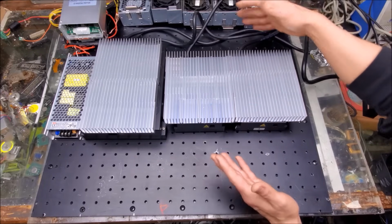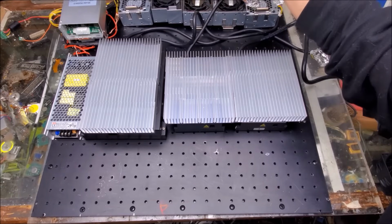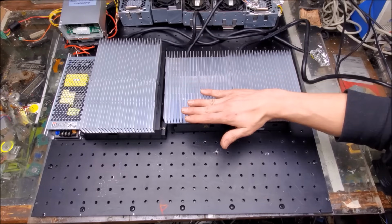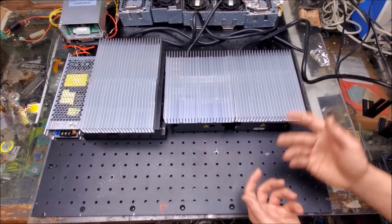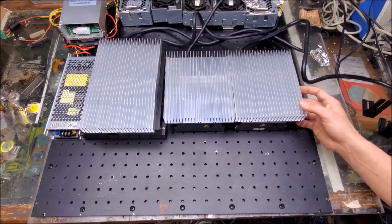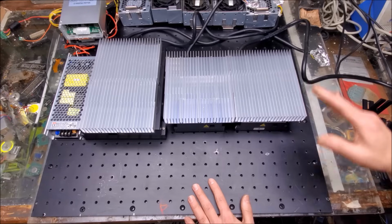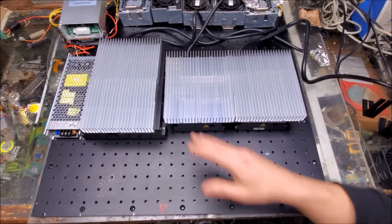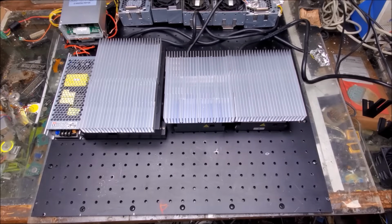So on the bottom of the laser, the air from the fans is going to come in from the back, get blown down under the optical breadboard across these heat sinks, and vent out on the bottom. We're going to put feet on the bottom of the laser, raise it up about 1.5 inches, and that should provide good airflow. In fact, with those fans, once the laser's on, it should weigh about 10 pounds less because those fans are pretty beastie. A couple of other things to put in, which are the drivers for the green and the blue laser. So go ahead and put those in place.